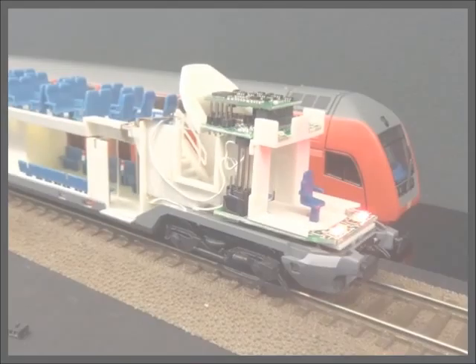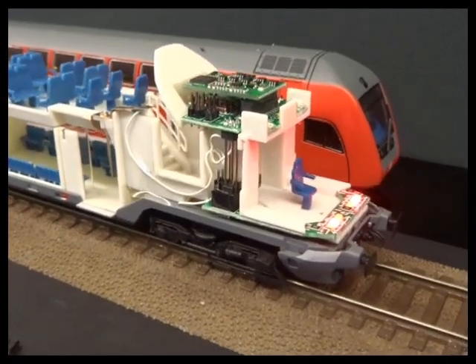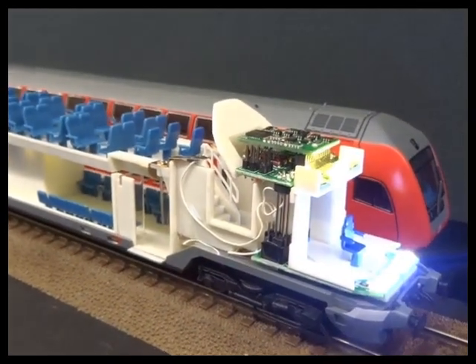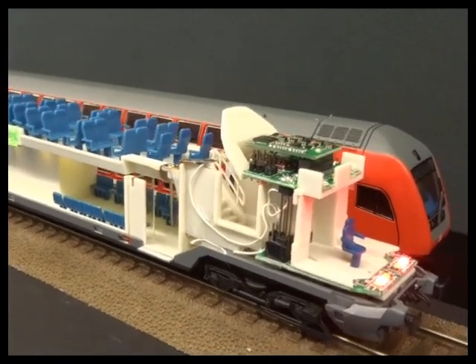These are just a few changes to the setup that the Lenz chip is delivered in. You have to appreciate that manufacturers can assign these pins to whatever they please, so quite often when setting these things up you'll find that the lights aren't controlled by the function you expect.